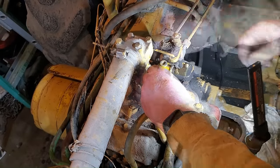But if I touch, so here I am at the starter. Hold on, I'm gonna switch sides. See? So I've got 6 volts here at the starter solenoid. It's just something goofy is going on with the wiring. Sorry, I'm moving my cables around. So I've got 6.3 volts here, and that's actually about the same as what I have back at the battery. So it's not like the cables are old and crusty and drawing a bunch of resistance. So that's discouraging. I've got an electrical problem up with my wiring and also over with my distributor. I've got to put a tune-up kit in that. So it's a no-go for today.